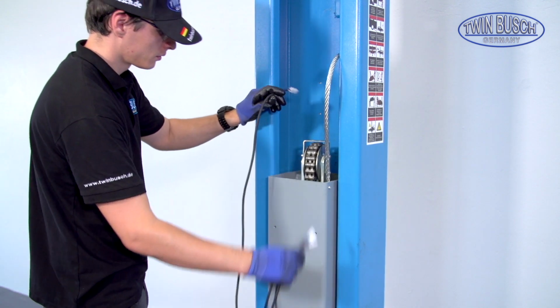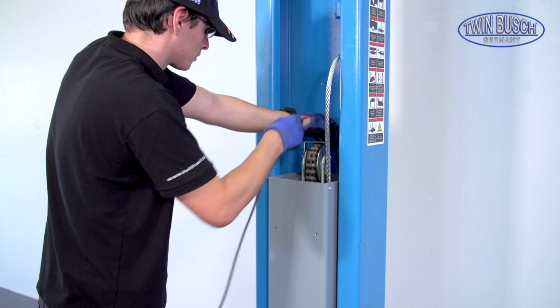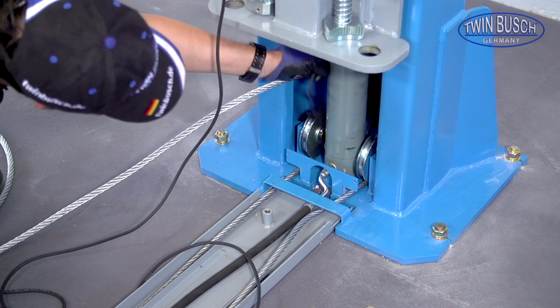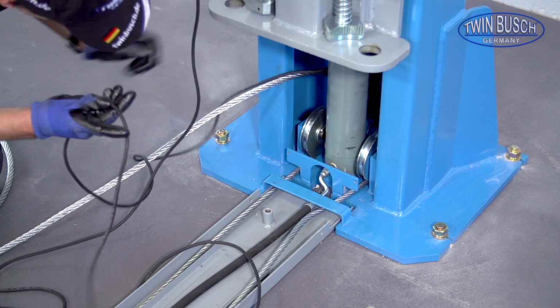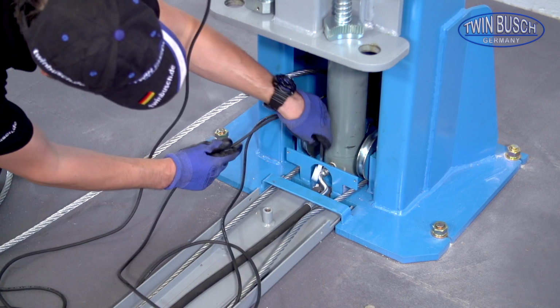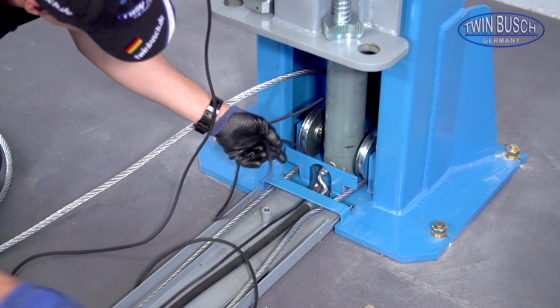Connect the electromagnets from the assistant side with the long Y cable. Make sure that the cable cannot be pinched during later operation. The long end of the cable goes towards the main side, while the other 2 plugs will be connected to the electromagnets from the assistant side.